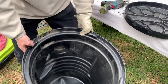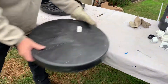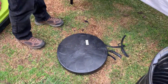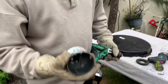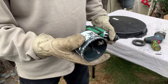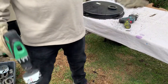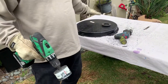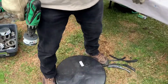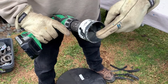Let's go ahead and drill the holes — just turn it upside down. I'm gonna put it on the ground because our hole cutter has a leader on it. So we have a hole saw and it's a three-inch hole saw. We're using a three-inch because eventually I'll put a three-inch grommet on there. I figured why switch around with different heads — just use the same one you're going to use on other parts of the construction.